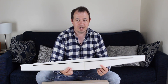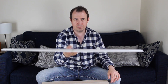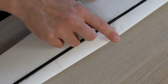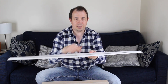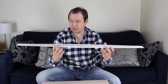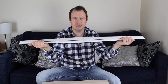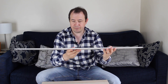This is the wing I came up with — just my first test piece, but I'm quite pleased with it. The wingspan here is about a metre, and this thing weighs less than a hundred grams — it's very light. It's actually made of six sections that have been 3D printed, all held together using epoxy. This strip you see through the top is the carbon fibre strip embedded into the top surface. I will cover this with something — tissue paper, or maybe some iron-on plastic. But I have to say I'm really impressed with what this carbon fibre has done — this is incredibly strong for something this light. I'm very, very pleased about that.